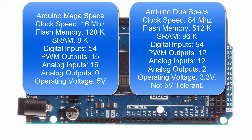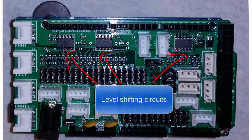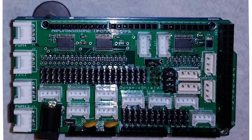One problem with the Due and Zero boards, though, is that they are 3.3V systems and are not 5V tolerant. This means that a lot of sensors and actuators that work with the older Uno and Mega will not work with the Due out of the box. You'll need to level shift those voltages to be able to work with them. Luckily, the Dynamic Shield solves that problem by level shifting a lot of the IO lines for you, including all of the pulse width modulation lines.